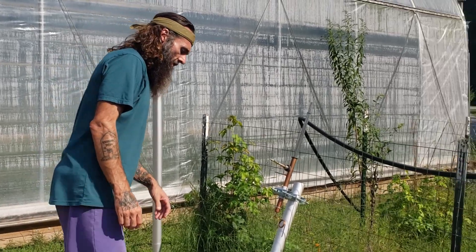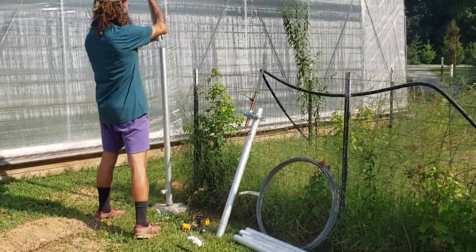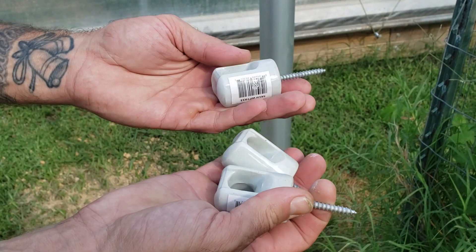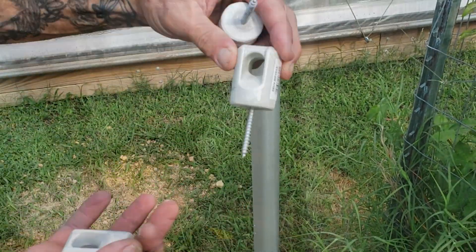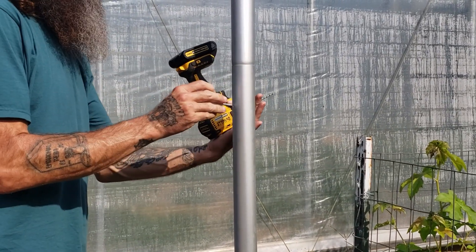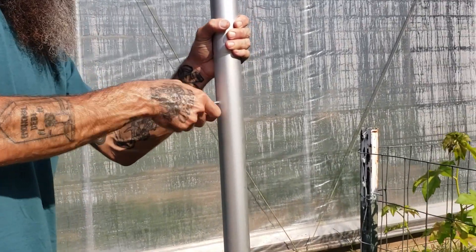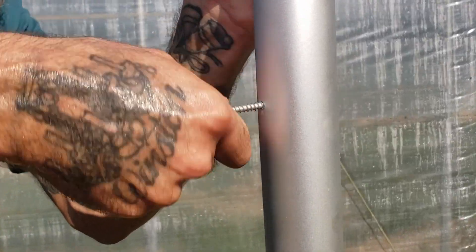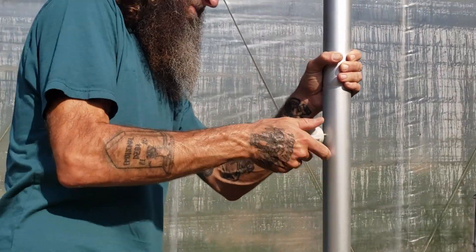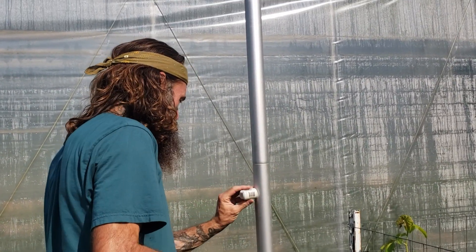I'm prepping some of the components of the mast. I have the antenna head — the CW1 antenna head — mounted on the top section with a mast-to-mast mount. These are the ceramic insulators that will go up the pole, and the wire that connects from the pole to the ground line will go through these insulators as it travels down. You have to pre-drill a hole with a drill bit and then just screw these on. I'm going to use one insulator per first section, which is ideal.